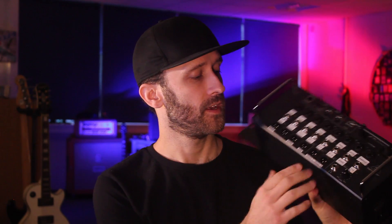This is the mixer my band uses — it's the Behringer X-Air XR16. It's 16 channels in, 4 mono out and a stereo out. There are loads of different mixers you can get at all different price ranges and numbers of inputs and outputs. This is one of the cheapest available. They also do a smaller one with just 12 inputs and a slightly bigger one with 18 inputs, which has a couple more outputs. It all depends on how many channels your band needs in their ears and how many members need mixes.